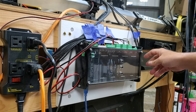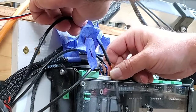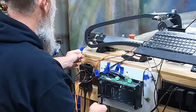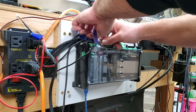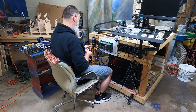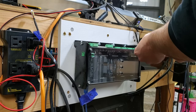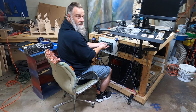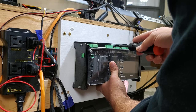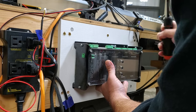All right, so now let's unplug everything. Careful with these induction sensor ones. We don't want to pull from the wires here and pull it out of the casing. So we want to make sure we get that casing and pull from there. Grab our screwdriver. Get the right size bit here. And now I'm pretty sure this is the point where I'm going to speed it up. That's why I left that top screw for last, so at least I had something to hold on to. And then just try to fall forward. There we go.